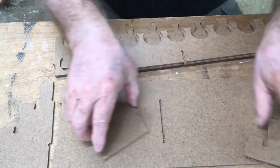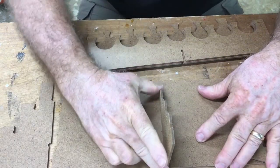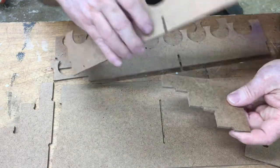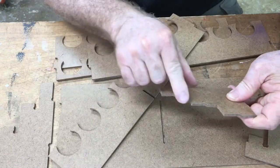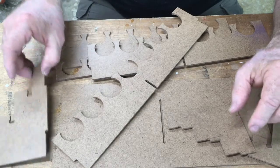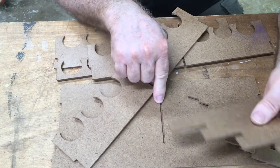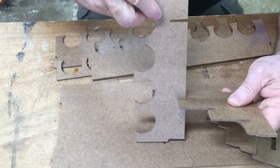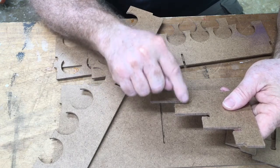Let's see how this goes together. This is the hole where I did not use the dog bones. I used the dog bones in this area, and that actually fits perfect. The other thing I realized is these still came out too far — that's a flaw in my design. I had to cut this off in three places to make it fit. On the dog bones, they should be 1.35 diameter, but when the dog bone actually cut it out it made it larger, so that is going to leave a gap. In the future, I'm going to take the dog bones out and just take a little file and catch the corners.